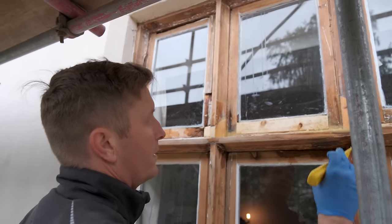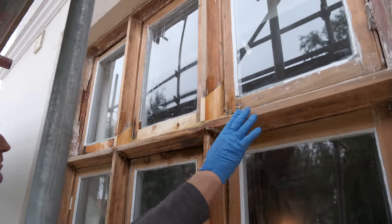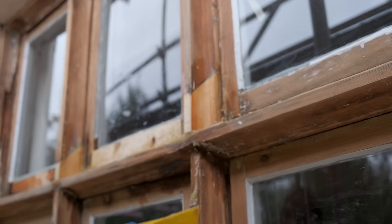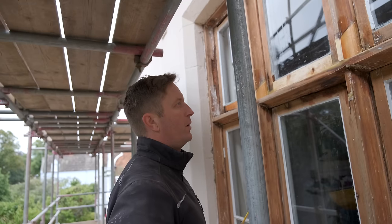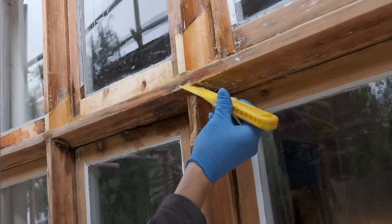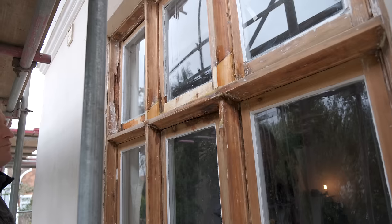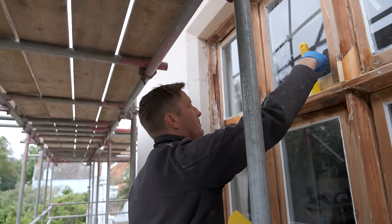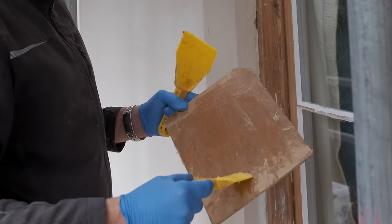So you can sort of see what I mean when I'm working this — I can bring those faces in around there and around there. But it won't really let you get this edge right. The company do sell Perspex strips that you can use to put across there — it does work, but you end up with little hollows normally. So I normally like to build a line across the front like that, and then try and get a crisp line on it. Within a couple of hours this becomes almost like a stiff gel and you can work a lot better — you can actually scrape around and get the profile back without losing this front edge. It's very important wherever possible not to overfill too much, because it is so difficult to sand, especially right in the corners. You're just not going to get in there with anything — perhaps maybe a Dremel, but life's too short to go around sanding things that you could have trowelled up properly in the first place. The four-hour gives you time to work with it rather than spending hours trying to sort it out the next day.